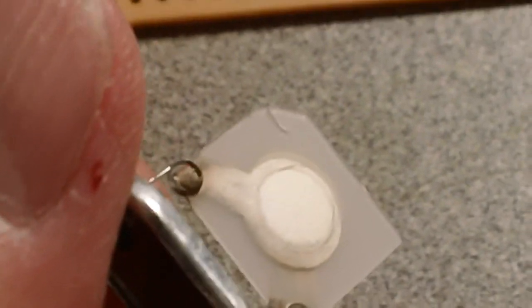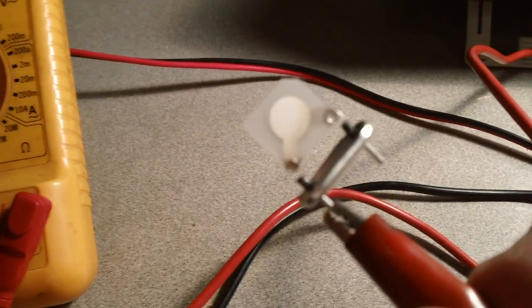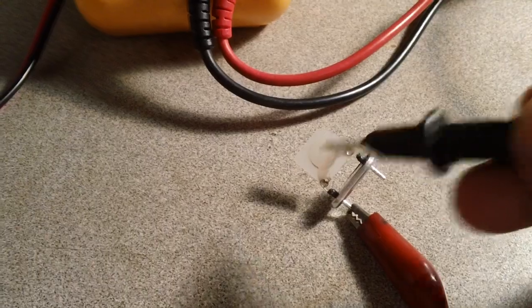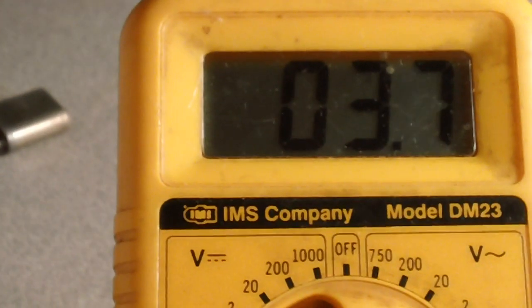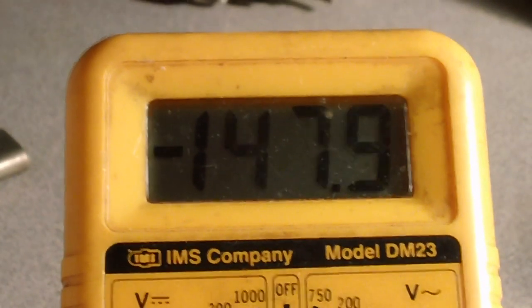It's about as clean as I'm going to be able to get it. I took a Q-tip to it and cleaned the connectors at the bottom. But that black one right there looks like it may not be connected to that paddle. I'll try a multimeter reading on that before I shoot the juice to it. I've got the red lead of my multimeter connected to the end of the paddle that has the burnt spot. I'm going to touch it to that paddle right there — I call it a paddle, it's just a contact. Keep your eye on the multimeter. It's good. Move it over to the other side — we get a reading there too.